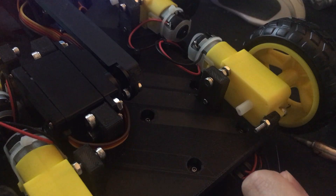Unfortunately, while testing the Robodog's movement, one of the motor mounting brackets had broken. Because I used PLA — the material used to 3D print the base and all other parts — it's meltable at soldering iron temperatures. So I took a soldering iron and did some very questionable plastic welding. As it turns out, it actually worked pretty well.